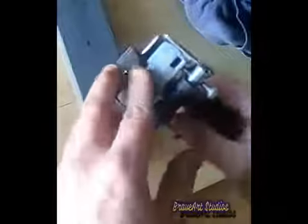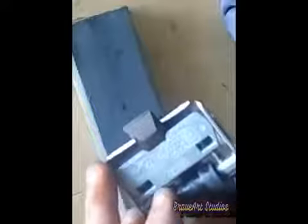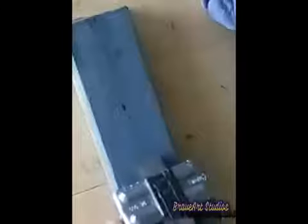I don't know if you can see it, you probably can. That's got two angles on it. So I'm about to do the 30 degree angle. And off we go. Okay, for the 30 degree angle, we flip the stone over so that it's the lighter side, which is a finer grit. And this gets us at the 30 degree angle on the end. Make sure there's plenty of oil on your stone. And you have to take off the burr off the back.